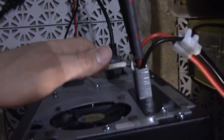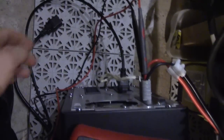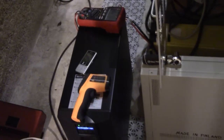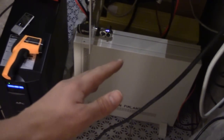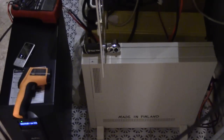Anyway, I figured we'd just turn that off now and plug it back in, because I'm a bit curious to see how quickly this recharges our batteries. And that's one of the reasons I like these traditional APC UPSs. The battery is always entirely isolated from the grid, so there's no risk in me doing that and having it connected to my entire open battery setup here, because everything's going through the two transformers in the unit, and they are isolating transformers, not autotransformers. So this can actually double as a charger for my solar system if I needed to, which is something that one won't do, because it's just got a buck regulator for charging the battery, so it puts the battery at live potential, which is no good at all.